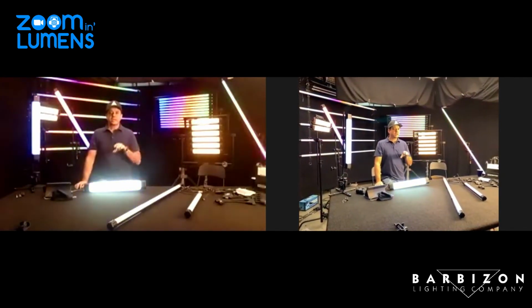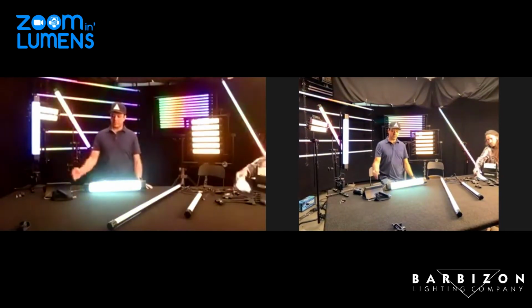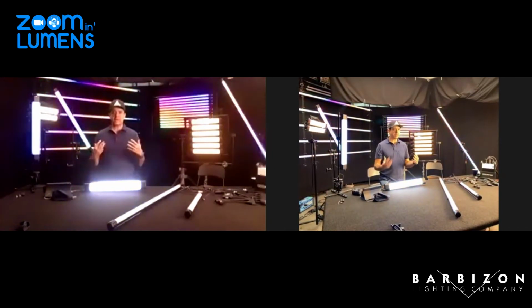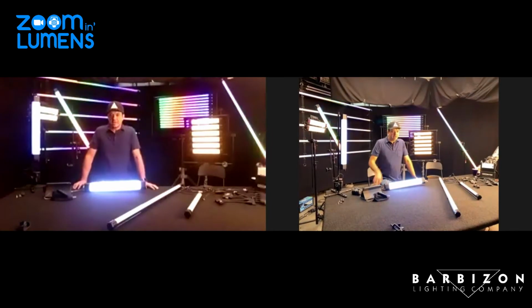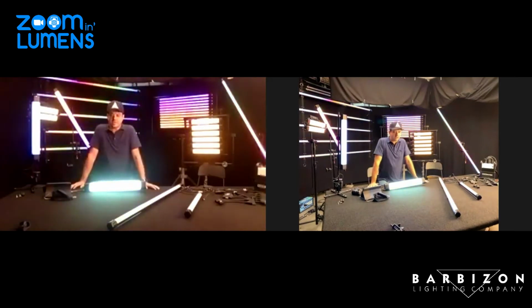Over Ethernet, it will take ArtNet and SACN, so two lighting protocols that you can put right into the light, because with these new lights, they take a lot more channels in a universe. So you're going to want to have a better distribution of your data throughout your network, so you can run Ethernet to it. That way you can do many lights off of one string of Ethernet cable.